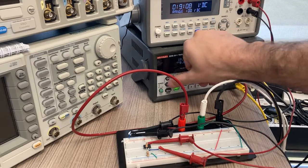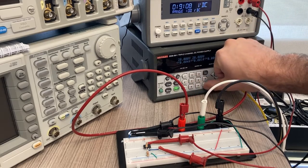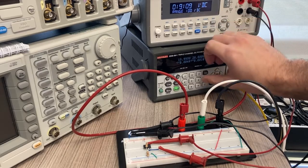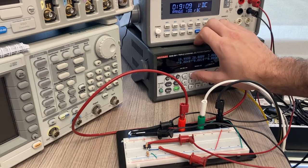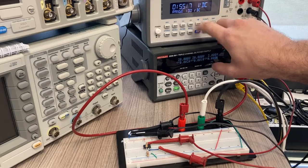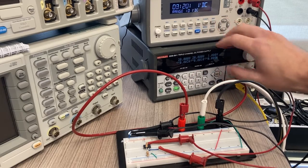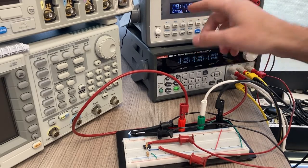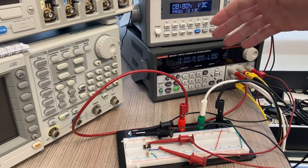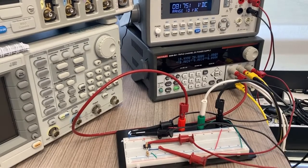We gradually go through a series of voltage steps: from 5 V, then 4, then 3, then 2, then 1.5, then 0. I'm just changing the channel 3 voltage gradually and observing the voltage output, recording the input and output each time. With this we can observe the linear and saturation region of our op amp, since the output is limited by the supply rails and we won't always get the theoretical gain.